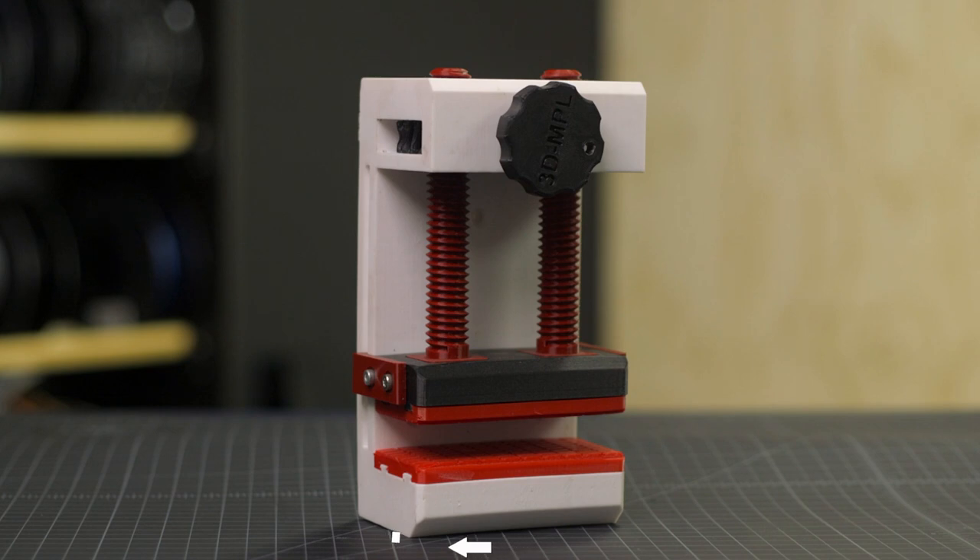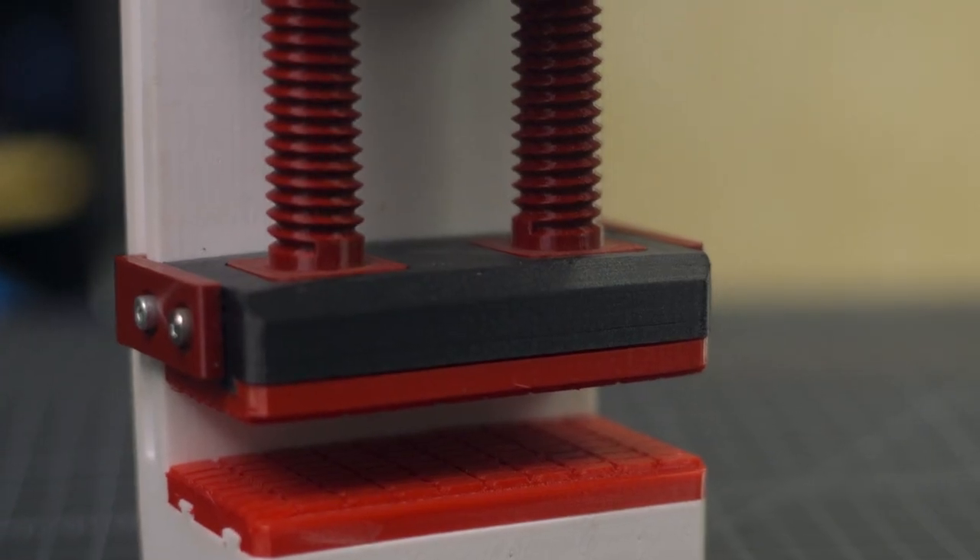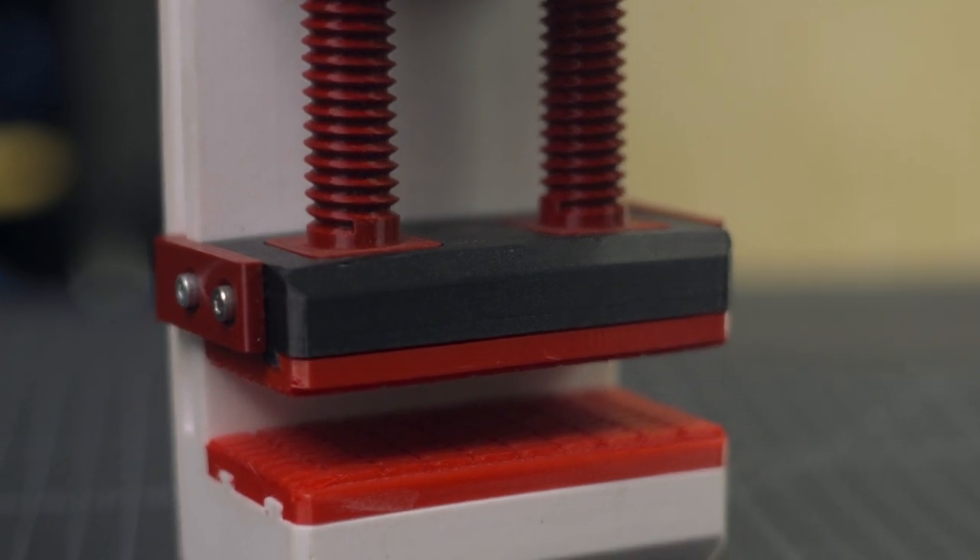In general, 3D prints will shrink in the X and Y and grow taller in the Z, and that really depends on the geometry of the 3D printed part as well. So if you have something more mechanically designed, like a vise or even the jaws, those might fare better just because of their big blocky nature — they don't want to warp in really uncontrolled ways.